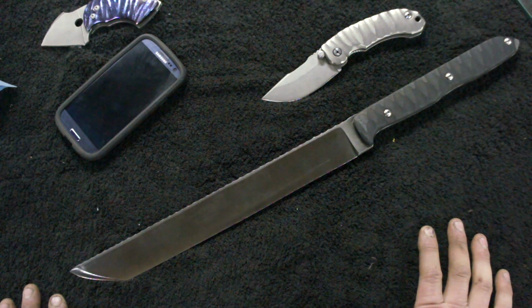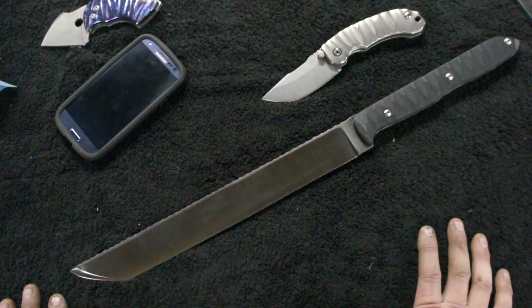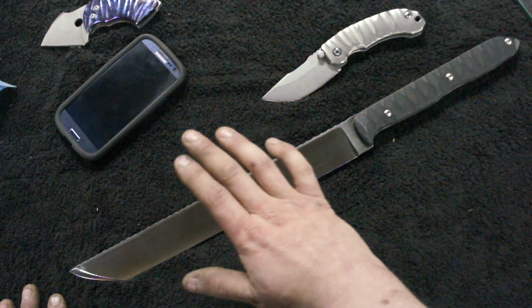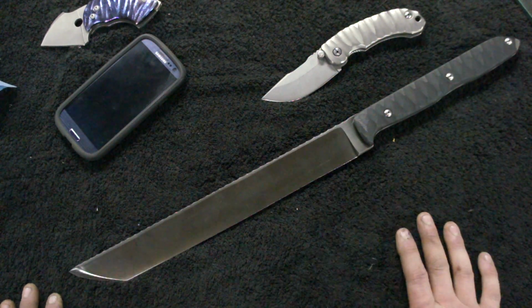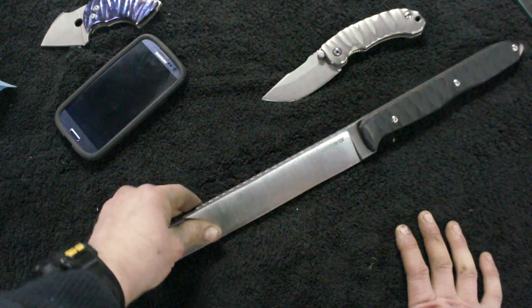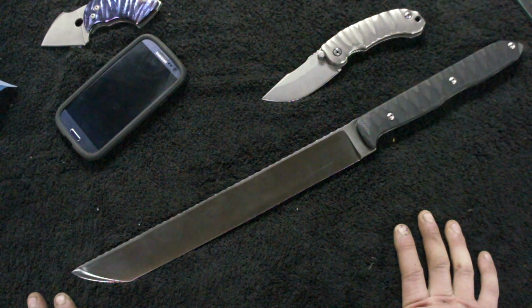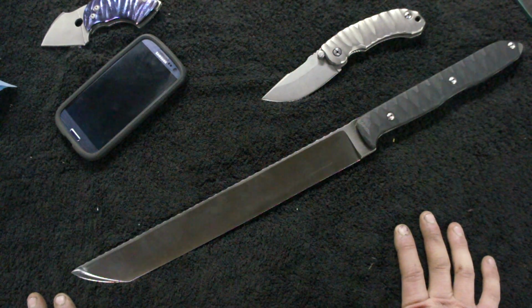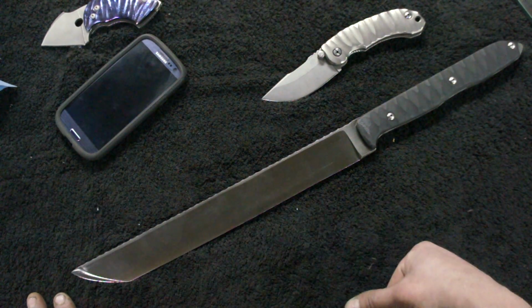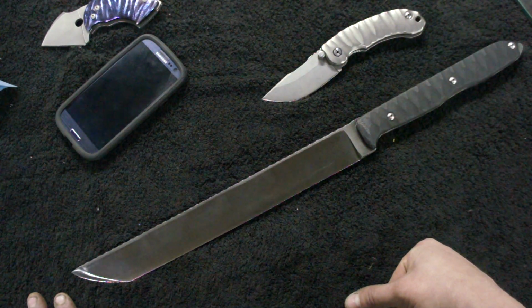But once that happened, there's a video of it. Mike has it. He'll show it. This was heat treated separately from the toads, so it's nothing to do with the toads. The guys who heat treated are experts. It was just the fact that I brought this in without any idea what kind of steel it was. So they basically had to find out first, and they had to heat treat it a certain way, and it also might have been me burning the edge in one spot too. So right where it broke is where it burned, so it was a combination of the two.